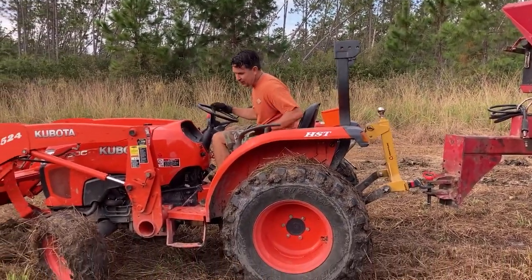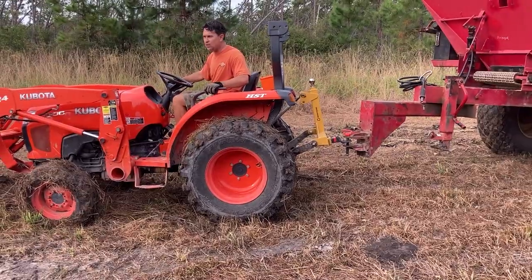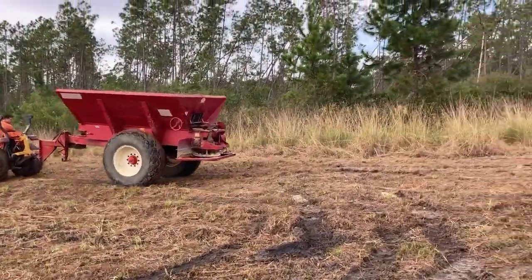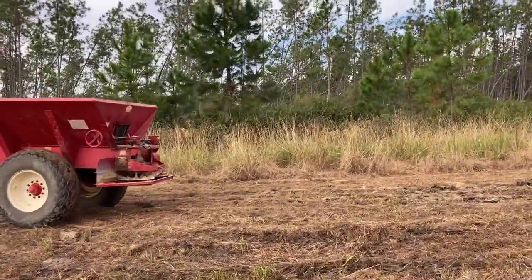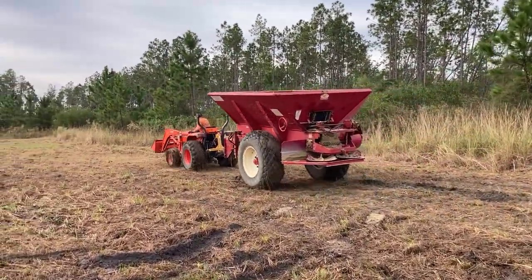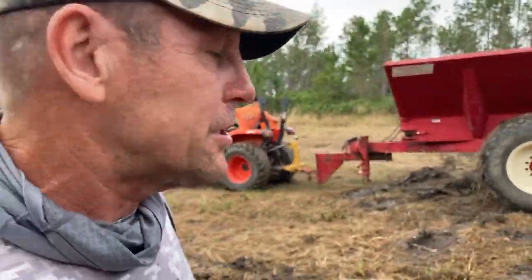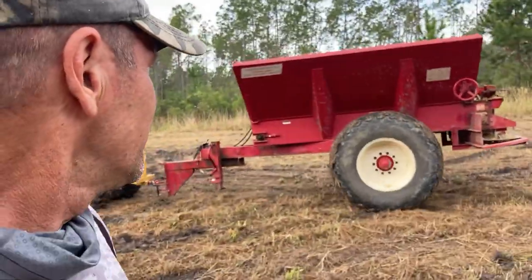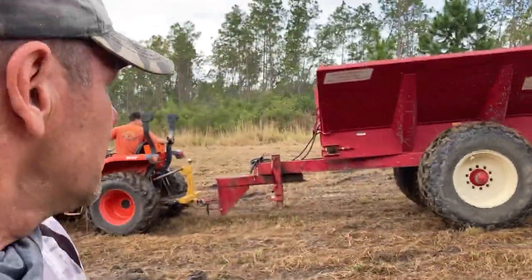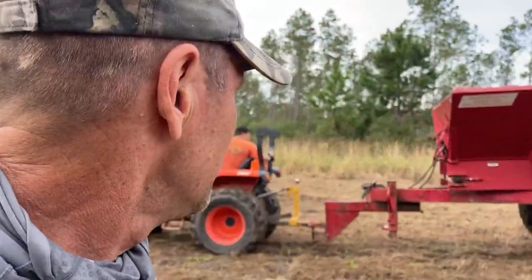Now you're in a bad place. It's got a very narrow path here where it's dry, and when he's backing up fast you can see the tractor's sliding. He's almost kind of ruined that path right there. We didn't get it on camera, but I just climbed in that lime buggy and shoveled all the lime to the front of the buggy to put more weight on the back tires of the tractor. You can see it's already helping a lot. Those back tires were so light from the lime buggy lifting up on it, and now he's got tons of traction.